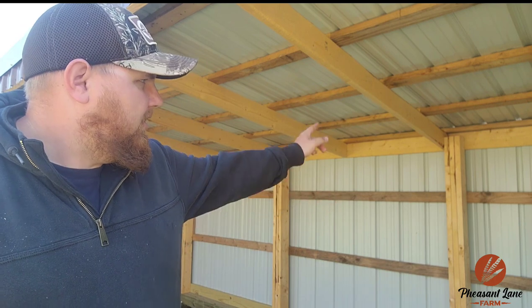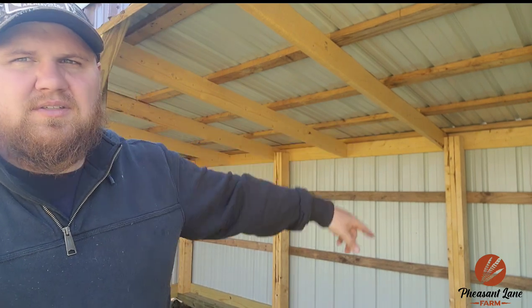I had him mill me down some boards, I believe 50 or 52 of them, I don't remember. I said, give me some 1x oaks just for their strength, but we don't need to go overboard on them. And 1x10s, they're kind of a variance. I told him they don't need to be perfect. Get me close to 1x10. I think a couple of the boards might be 1x8s. But 1x10 by 10 foot long, we're going to go up 52 inches, which would be to the third girt from the bottom, or the top one that you can see underneath the trusses there.